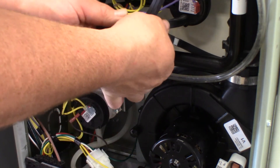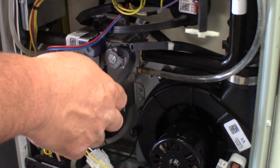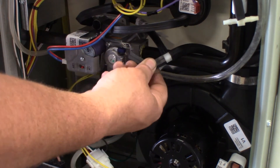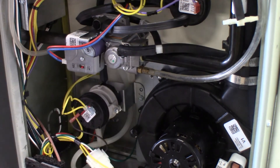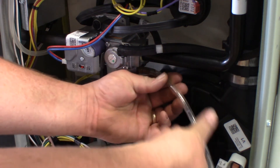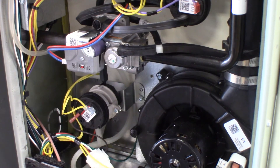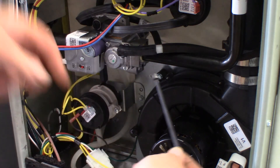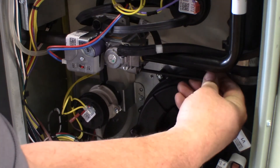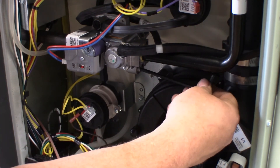After finding out our high-fire, we're all set. The manifold gas valve has been set up properly, and now we can unhook everything and place it back in the correct order in which we took it apart. One of the most important steps while unhooking the manifold lines is to make sure that we have pipe dope on the plugs going back in where we checked for pressure. This ensures there are no leaks on the actual gas valve, which would be a safety issue.